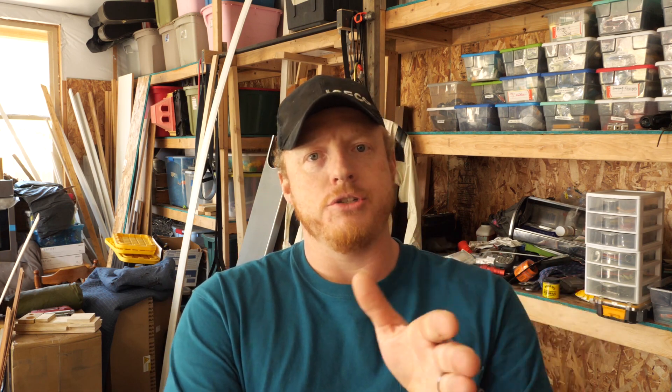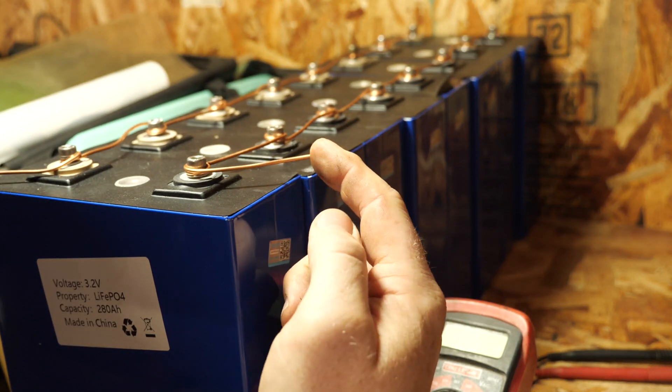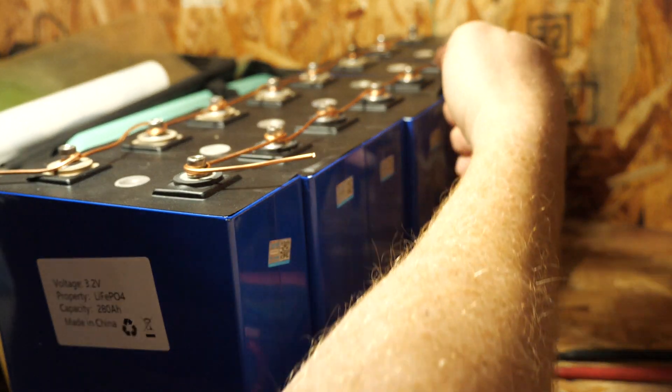What was recommended to me by a local battery expert is to charge them up as best you can, run them down, discharge them, charge them up again, and then put them all back into parallel. If you've watched a few of my videos, I had set all the batteries into parallel using some copper wire so everything was balanced around the same voltage. We're going to do that to find out whether or not top balancing is absolutely necessary.